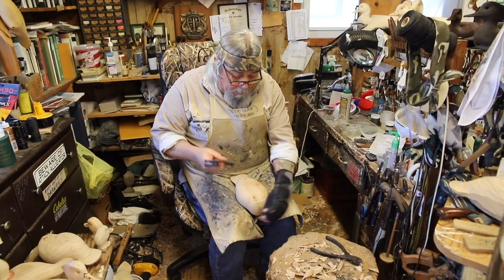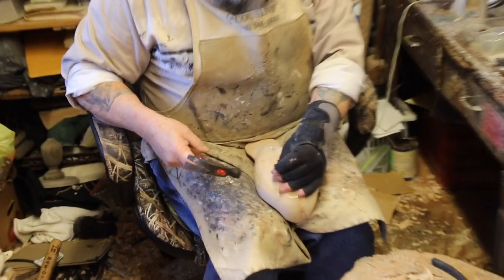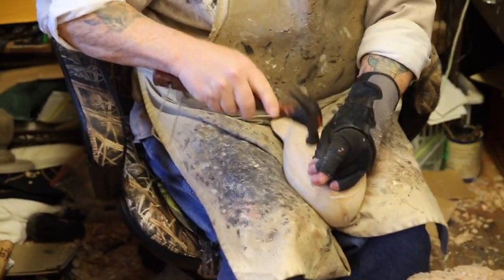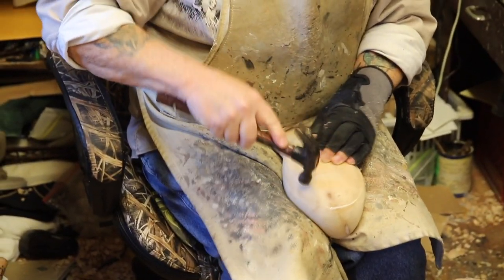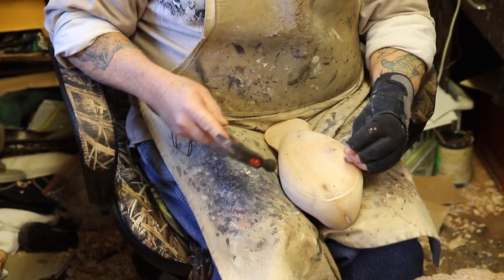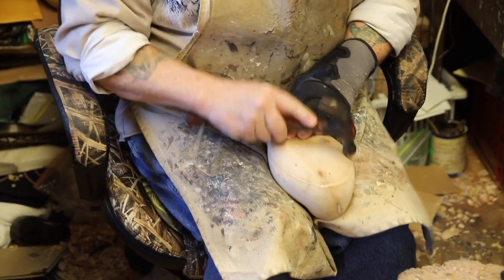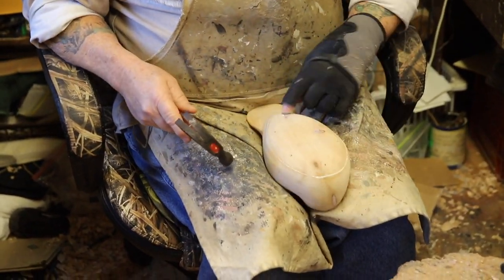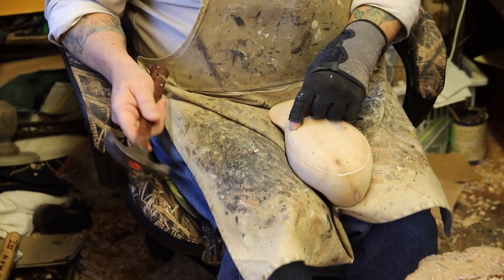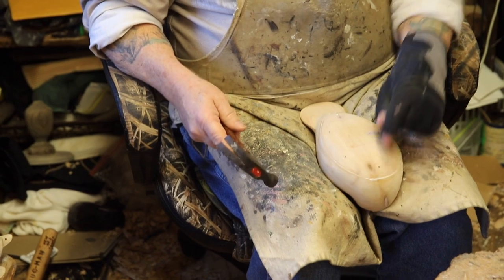You don't have to worry about your nails being stainless or galvanized. It's a gum bird. You're going to cover the head of it up anyway. You're going to countersink it. On the small birds like ruddy ducks, teal, buffleheads, I put 1, 2, 3, 4, 5, 6. On bigger ducks, I'll put 3 down the side. If it's really big, I might put 4 down the side.